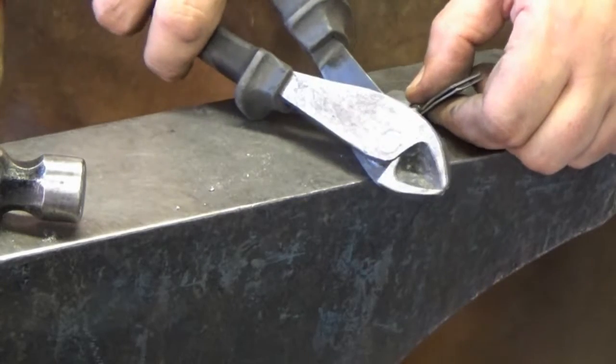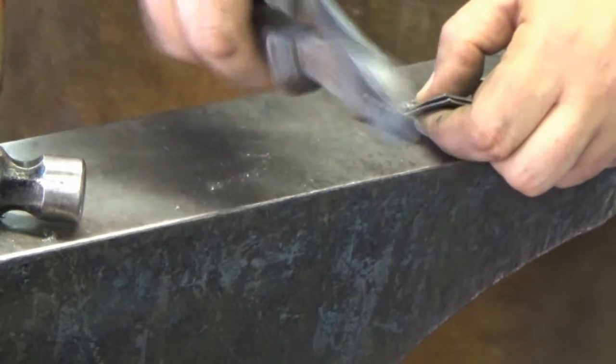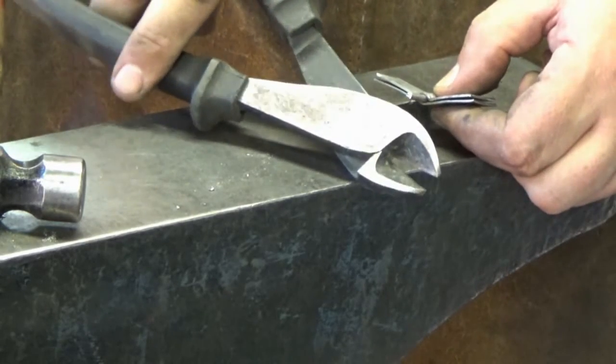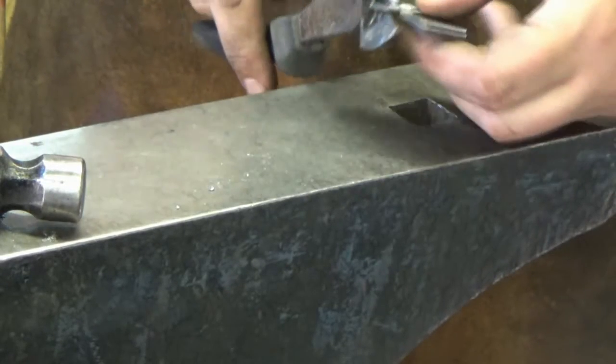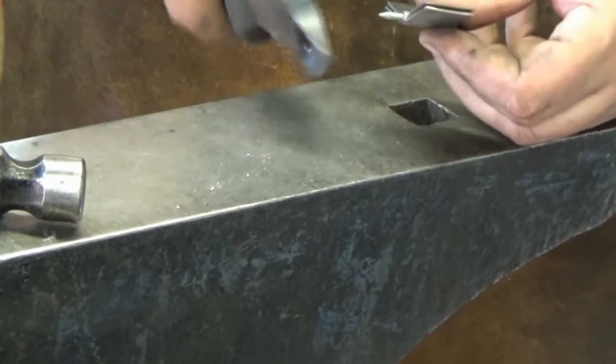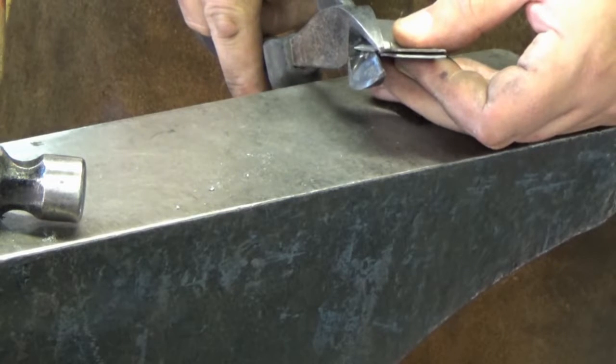Take your side cutters, or if you used a grinder, cut it, but I prefer you did it with side cutters, because you slip with a grinder on something like this, you're going to lose a finger. So take the side cutters and cut it with about 2mm either end. Doesn't need much more.